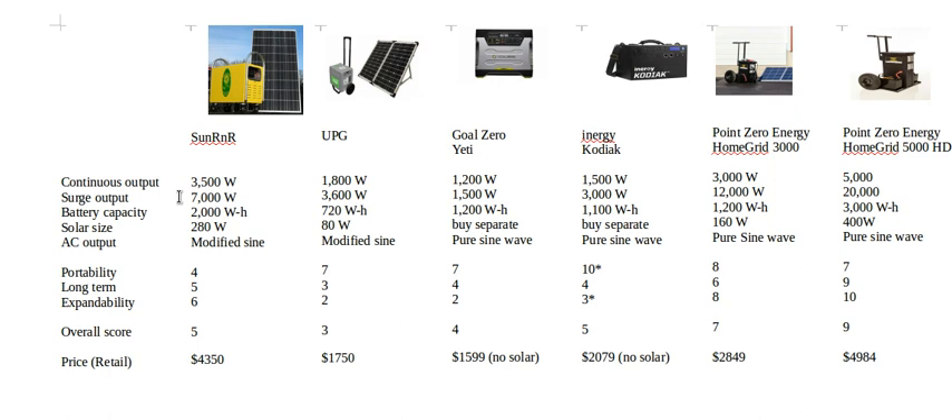Battery capacity is the amount of energy stored in the battery. During cloudy weather or nighttime the generator runs solely off the batteries, and how big that battery is determines how long it will run. If you run a microwave with a tiny battery it may only last a few minutes; with a big enough battery it might last a day of running a microwave if you needed to do that.